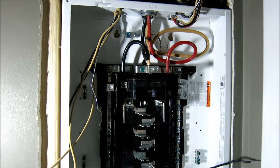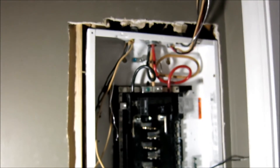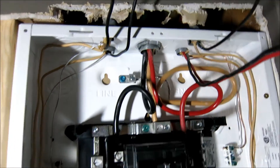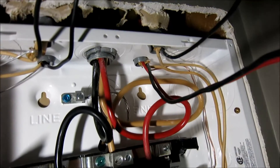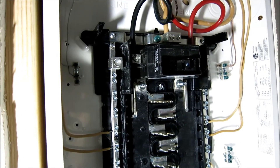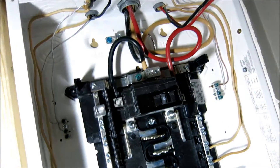As you can see, we went up top with the white — still connected all our neutral bus bars — and red on this side, black on that side, with our ground bus bars all ready to go. Now it's time to wire up the grounds and then start wiring up breakers. We've got our neutrals hooked up and all our grounds done, and our mains in. See how the mains have service loops? That's what you want. Those others that go straight up — that's not a good thing. You want a little loop so if you have to pull anything out it's a lot easier.